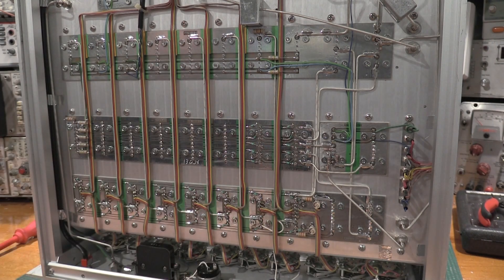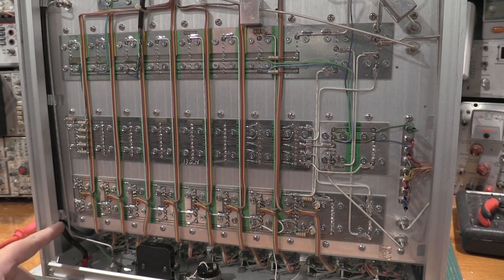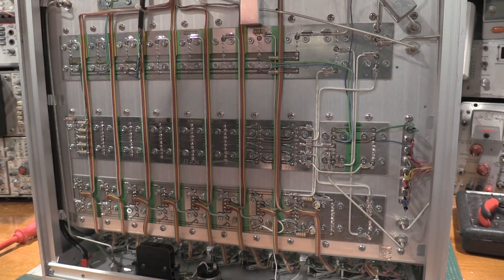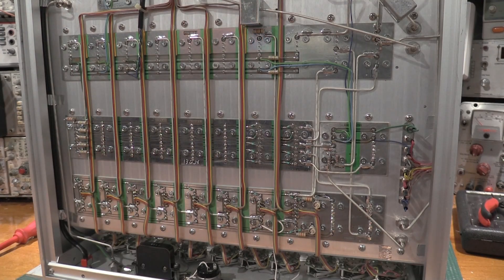Looking at the bottom of the unit — that is a good choice. So we have our meter, and that is the potentiometer. We have our main power switch. This is the output — we have a hard line that goes up, comes out of the decades. This is 10 megahertz in and out. The crystal goes up to the switch, so when you have 10 megahertz in and 10 megahertz out, the crystal's going to be out of circuit — it's just going to be humming along.